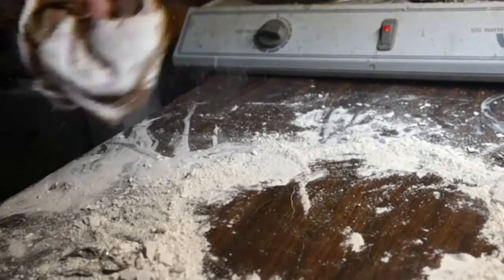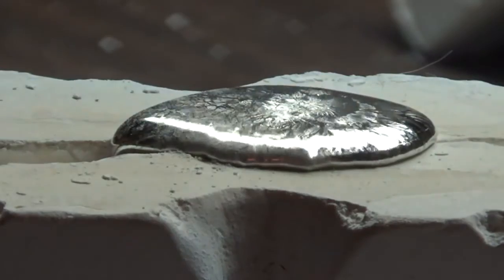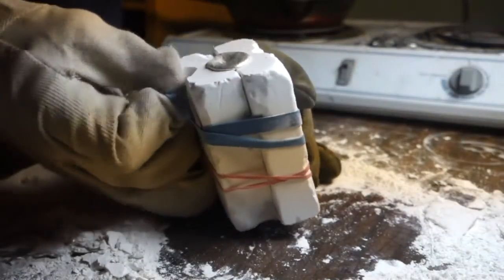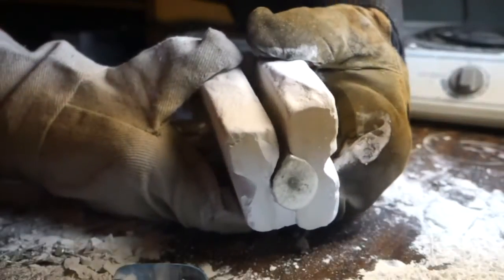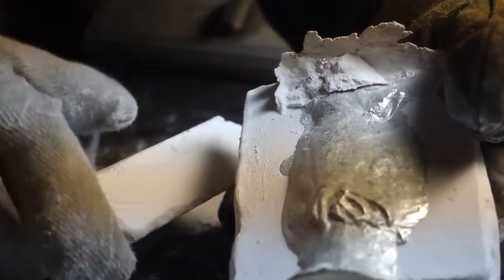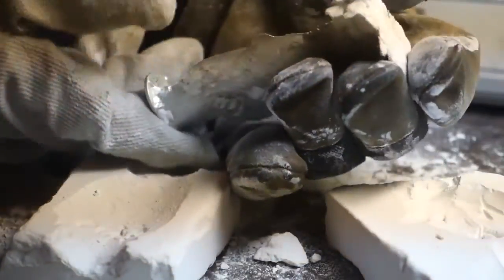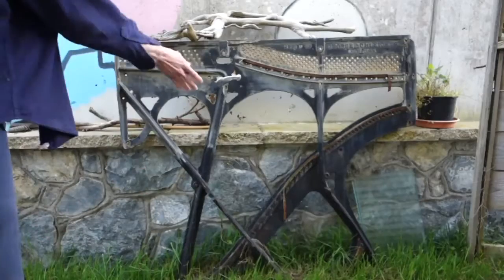Clean up your workspace and place your mold. All right, let's see how it turned out. Ease the mold apart carefully — wow, very nice definition in the eye and the smile. Tap it lightly to release the casting from the mold. There's our casting, ready for final cleanup. Cut off the gates.